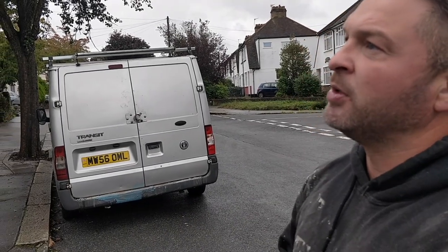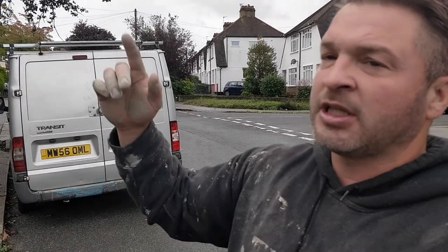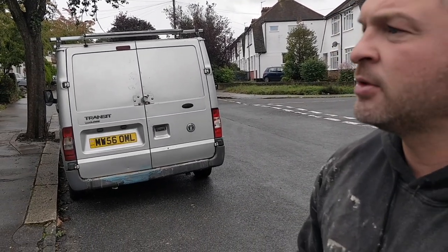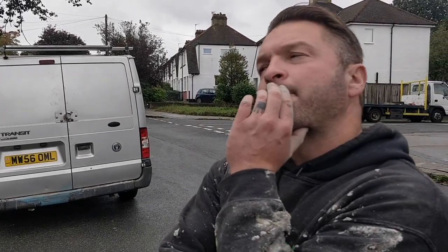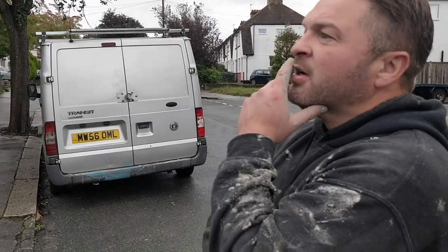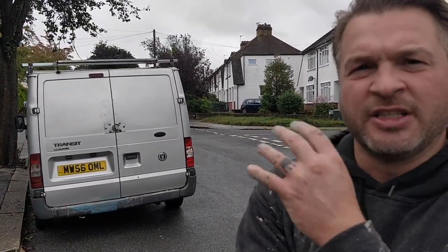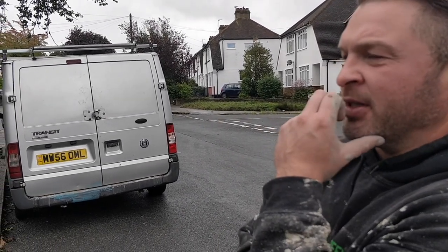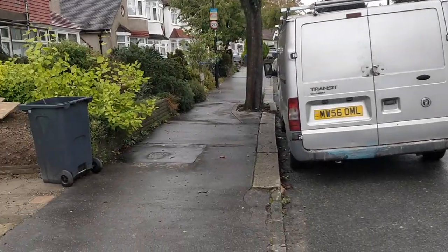And that's it. And then what we'll do is we'll wait for that to dry, prime it, and then we'll go straight back over with the silicone top coat. Nice. Okay. So there's, in effect, three coats. But there are six layers effectively: your acrylic primer, two base coats, your mesh. The acrylic primer is more for adhesion. It's not really a layer as such. Okay. So in a sense, it's like three coats. Nice. Cool. All right.